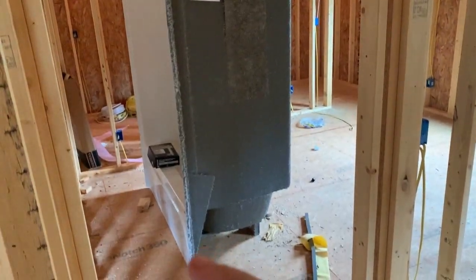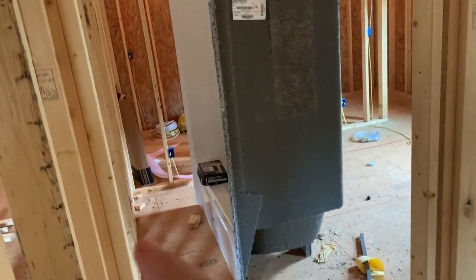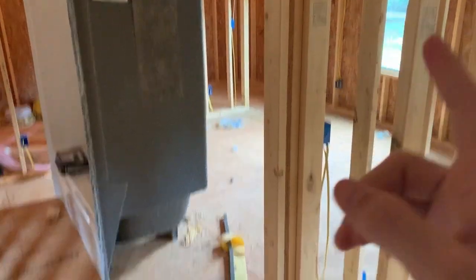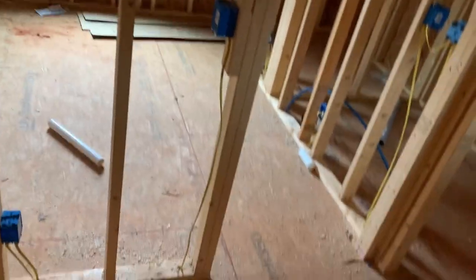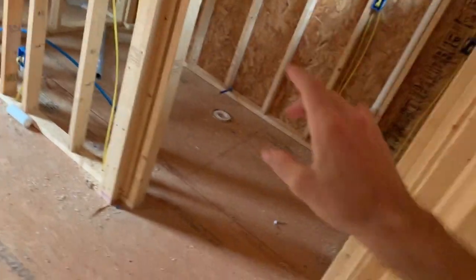Y'all seen the fan being installed. This hallway itself was with the bathroom because there's only a plug and a switch, so it's with the bathroom. The laundry room, or the washer dryer, by itself. Those lights in the laundry room by itself. The closet in this bedroom on one circuit. This bedroom and closet on one. This bathroom and the hallway, since there's only a switch and a plug, on one. And that's all we got.